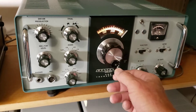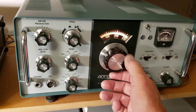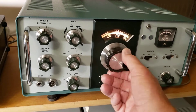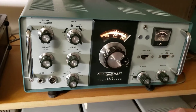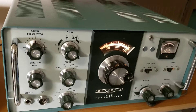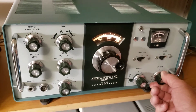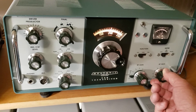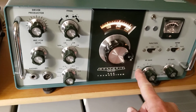The VFO is nice and clean. Tuning is nice and smooth — it's not jerky or anything. I checked the heterodyne oscillator crystals; they've already been tweaked with external capacitance as needed. It's got an internal CW filter. All the tabs are good.